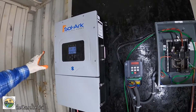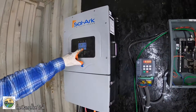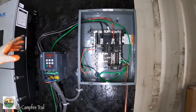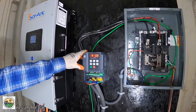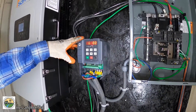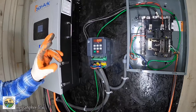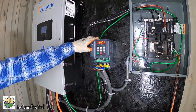All right, the short version: this is the inverter that's collecting our solar right now and charging our battery bank, and it's outputting to whatever we're running. This is our panel, which we're still in the process of working on. And this is what starts your well pump. This is a three-phase frequency drive, and we don't have three-phase power here — we have single-phase power. Single-phase power is two legs, two hots, or a split phase. So we convert that into three-phase using a three-phase inverter.